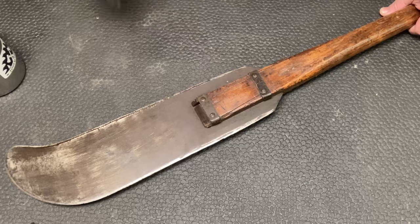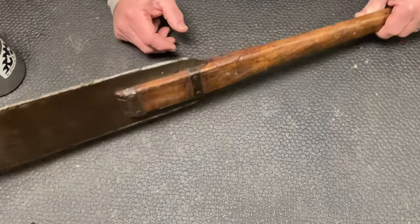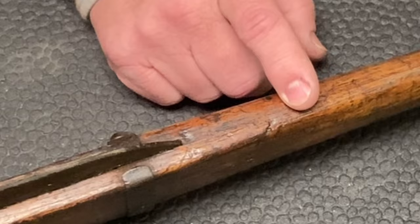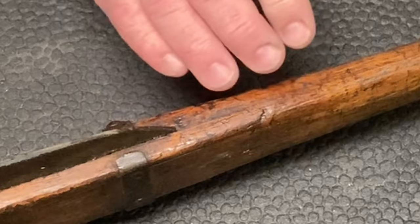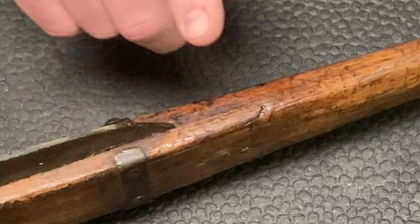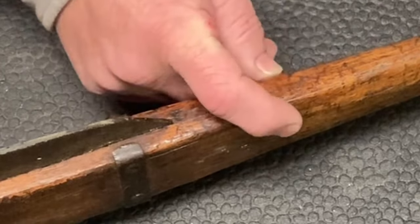So I think what I want to do on this, you can see where it's popped out here, and I know it's a lot more labor intensive, but let's really strengthen this handle by making it a laminated handle. I think what I want to do is cut 4 pieces that are 1/4 inch, and then cut 1 piece that's a little bit bigger than this blade here, run everything through the thickness planer, including this piece right here down the middle, and we'll basically make